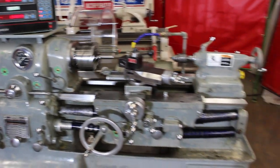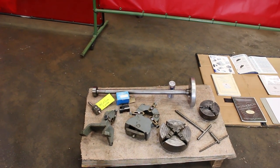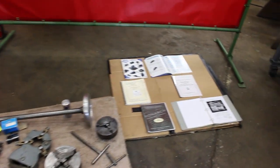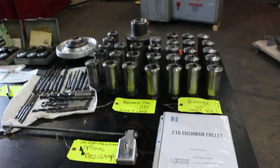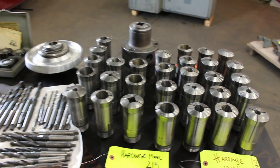Has taper attachment. Additionally, we're going to show the tooling package that we have with the machine, and optional: 3-jaw, 4-jaw, steady rest, 5C collet system. The machines always come with the full set of owner's manuals. Additionally, we have a full set of, I believe, 30 pieces of a Model 215 Hardinge collet set. It's called a Hardinge Cushman collet set with a super nice Hardinge collet chuck,